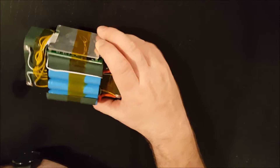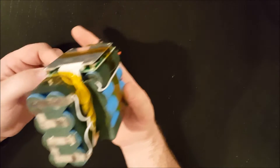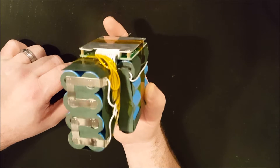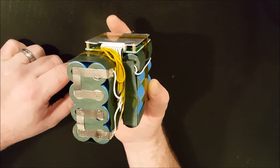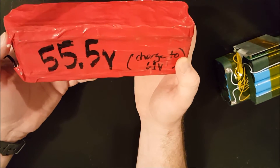I've tried a lot of different ones. This one is used in self-balancing scooters — it's a 37-volt, 2-parallel pack. The challenge with this battery is that it can't provide much current. A 1000-watt bike at 36 volts might be putting out around 30 amps, and that's a lot of current for this. The nickel strip here is pretty thin.